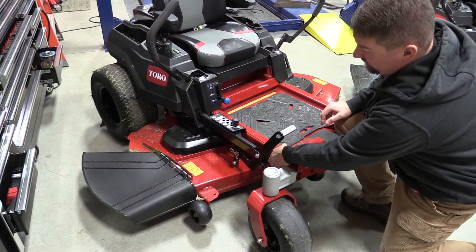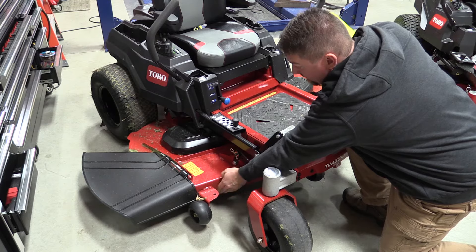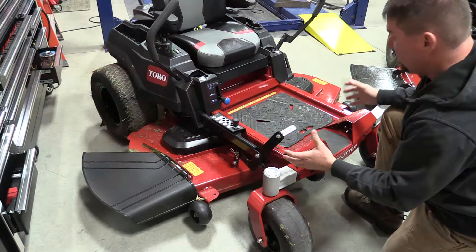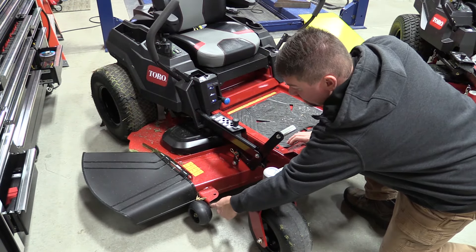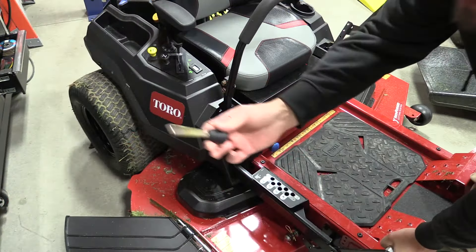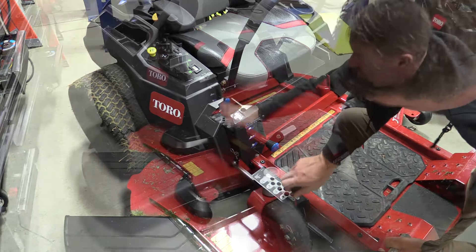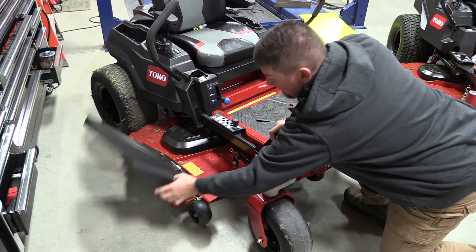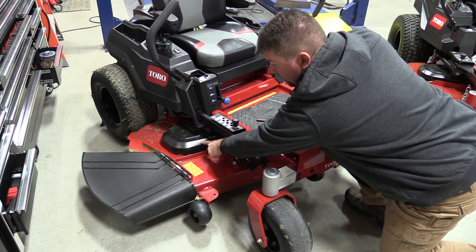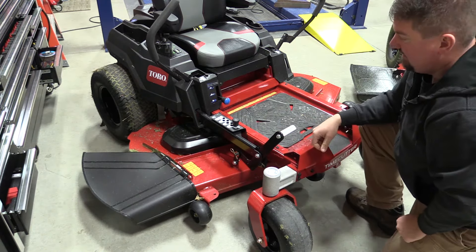The TimeCutter has a 10-gauge steel frame and a 10-gauge steel deck. You have a leading reinforced edge that goes completely around the full front of this deck and it is very, very sturdy. You have anti-scalp wheels that are adjustable up and down, a deck lift, and pin detents for the mowing levels that are easily accessible. This model has a spring-loaded plastic chute, and if you get some of the smaller decks you can get the spindle covers to be quick-detach. On this 60-inch model they are screws.